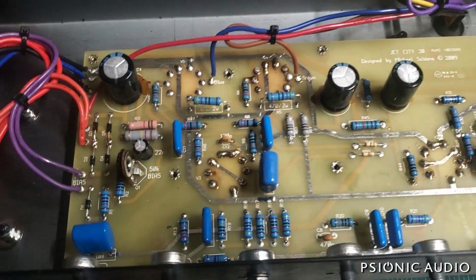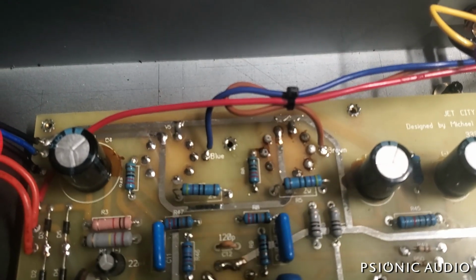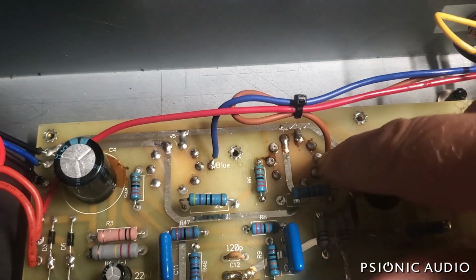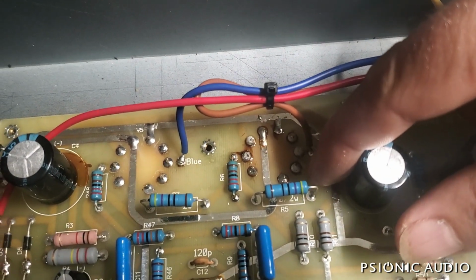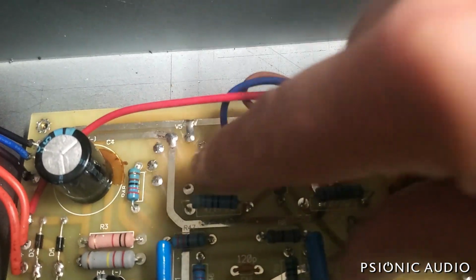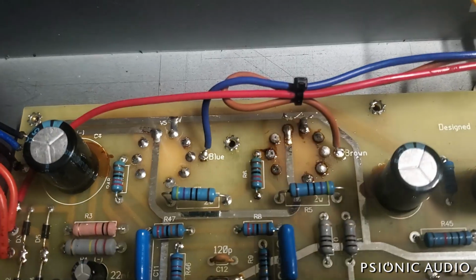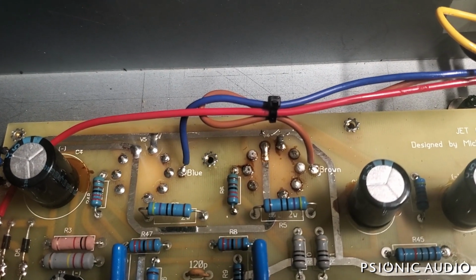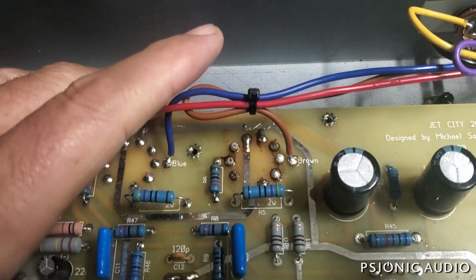And I have decided, out of the goodness of my heart, because I can't really bill for this, to remove the stock factory solder on these output tube sockets, because that's factory here, and redo it with proper solder that can hold up to the heat. I'll add a little bit more there at pin 9, but clean, no flux solder that actually will hold and not cycle when the board gets hot and cold and the tubes get hot.